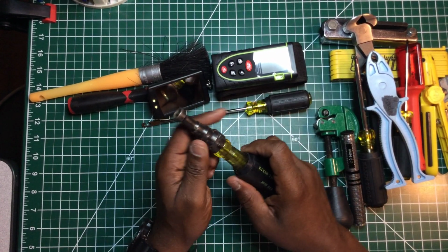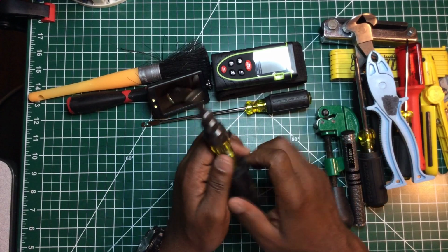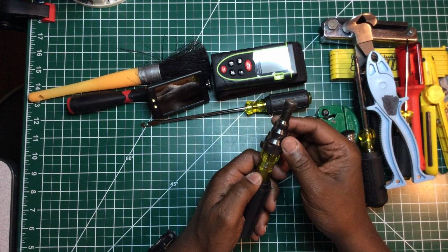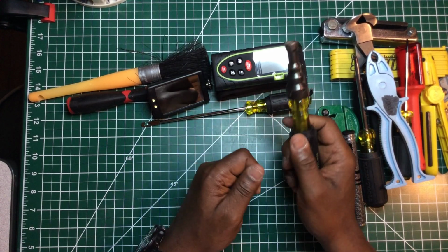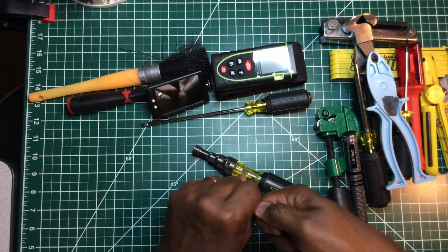This is a reamer right here for when you're doing conduit, EMT. This won't work on rigid. Rigid is too hard. At least I never used it on rigid before. I always use it on EMT. But very seldom do I use this because I'm so much in a hurry. I'll grab a pair of my linemen's, or I'll grab my needle nose and I'll ream it out.